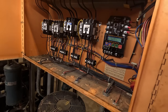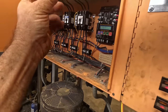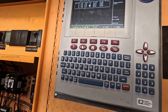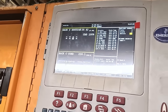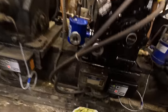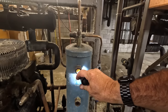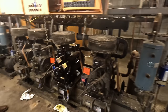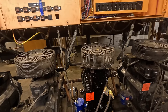You got the air - end switch. What's the end switch doing? Not always - anything open or close will work. Suction here at 27, we're down to it, so now we should start dropping down. Now it should pump down pretty good. Let's valve this baby off, we'll let it run for a while, we'll see how the oil goes. We've got plenty of oil in here - we've got a lot of oil in this thing. It's all the way full, so what we dumped out probably wasn't a bad idea.